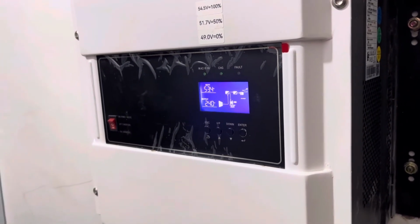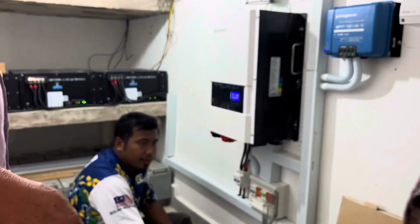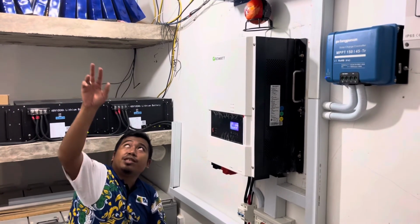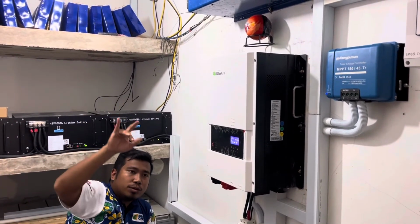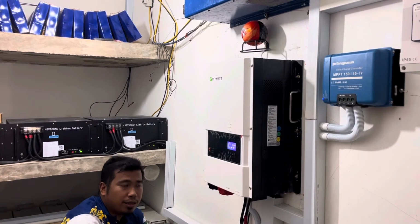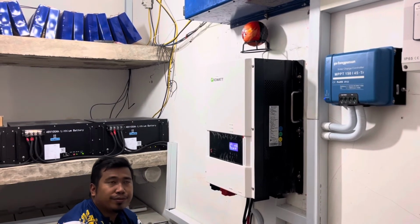Yes. That will be even better. We can switch off the breaker first, and then you can switch on. If you realize when they're switching, you see the light flickering. This most likely happens because of the fluorescent light. If you use LED, then it will be okay. Or any fluorescent light with ballast. So any change of frequency or whatnot, then you will see the changes, flickering.